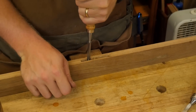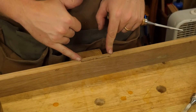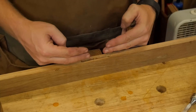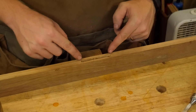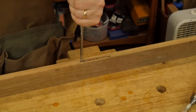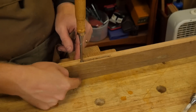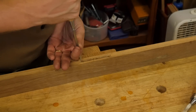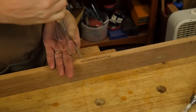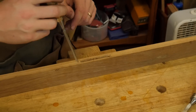I'm taking it off nibble by nibble until I get this line perfectly square, so that when the chisel is in the marking gauge line, it's perfectly up and down going all the way down into it. Sometimes I'll undercut it just a little bit so that inside the chisel goes back slightly — but this outside edge is perfectly tight. Because it's end grain connecting with the tenon, it's not going to have much gluing surface, so it's the face on both sides that is holding a through tenon. The chisel is basically up and down, and I'm going down about 80% of the way — I don't want it to blow out on the table, but I also don't want it to miss the line on the other side. I'll just undercut it just a hair by hand.